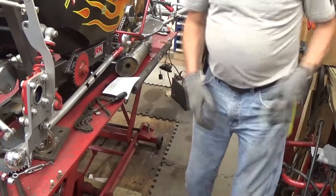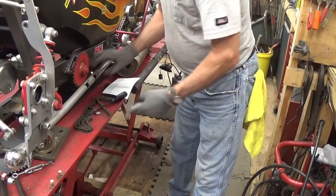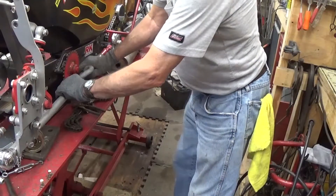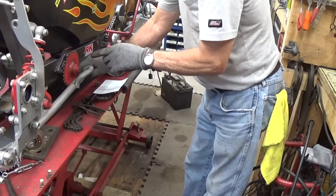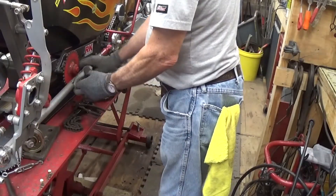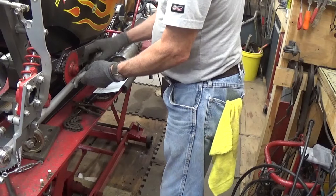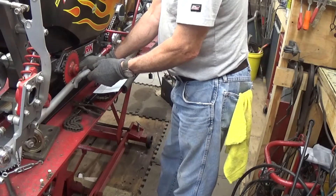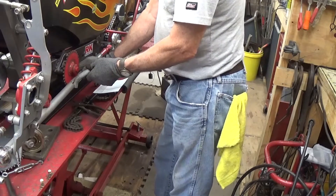Let's see if our piece will fit in there. Open this up a little bit more there. That's about what we want. I thought I could slide it back that way a little bit more. That'll do me right there — that's what I want. I can finish cleaning up the paint off of this and clean these galvanized fins up a little bit more, then tack them in place. Then I can take this apart and weld it up solid.